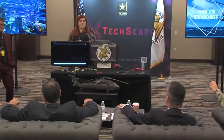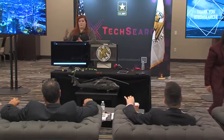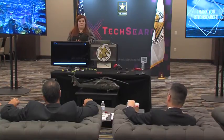These actually harvest the energy from the vibration of the aircraft to communicate, so they're wireless, and they don't require any battery. It works on an ask and receive basis. So you will have to ask for it, and it will send the information, and it will be able to differentiate between each other, so we don't interrupt anything that's going on.